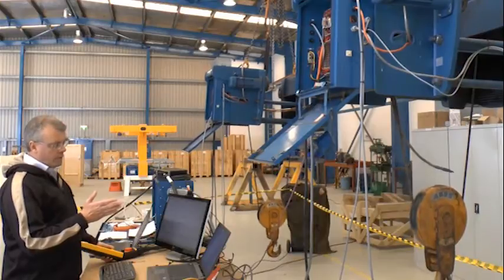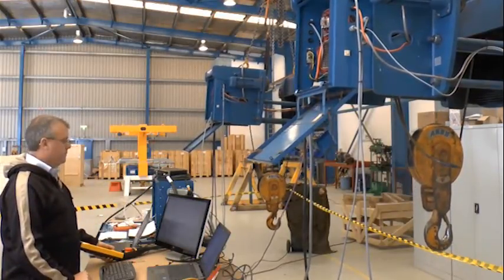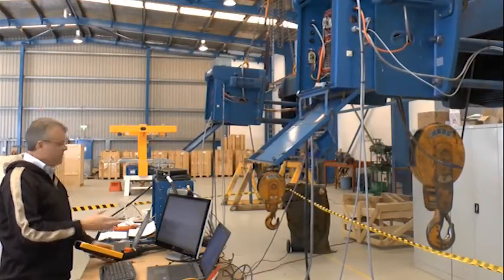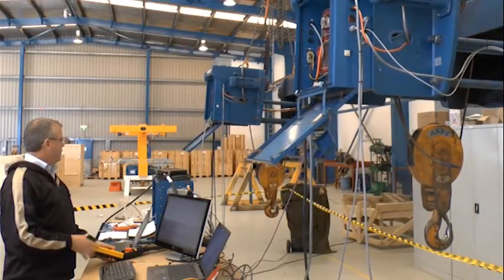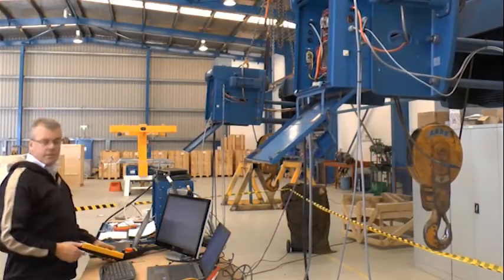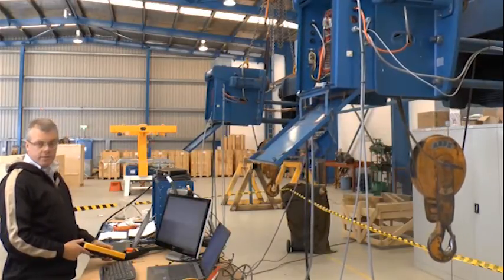We can see that when the hook which is in the highest position hits its slow zone, the other hoist will follow suit. This one was told to stop, so that one's told to stop as well. The customer can select the other hoist on its own, take the slings off, and if he wants to reposition his load, he can freely set that hook to wherever he wants. If he wants to make sure that they are absolutely positioned at the same point, he can bring it up to its stop limit and now they're definitely aligned. When we go back into synchronised mode, they travel together, synchronised once again.